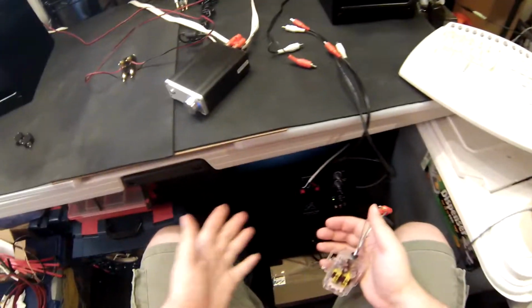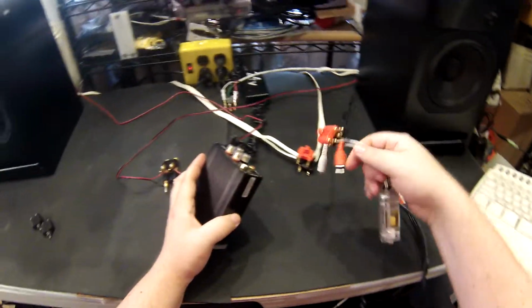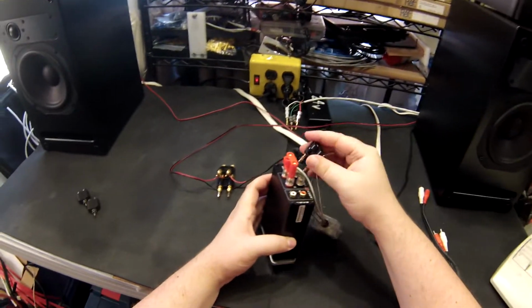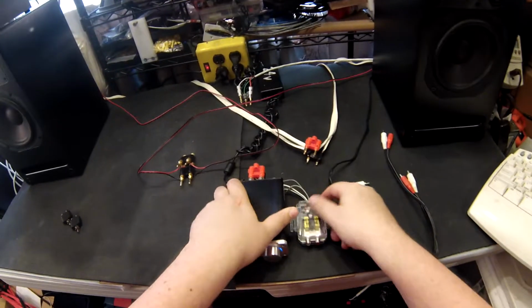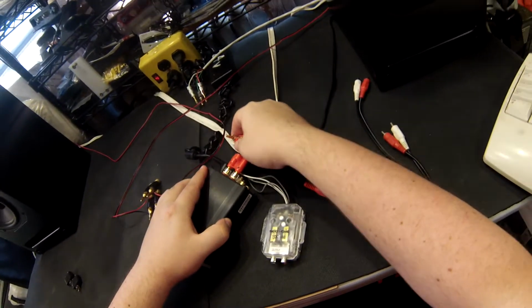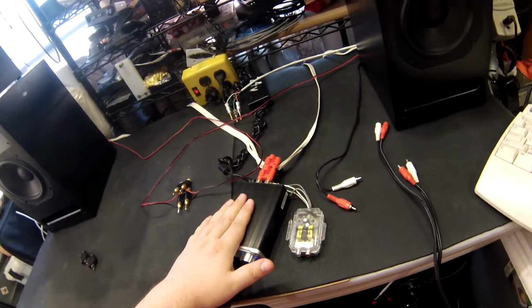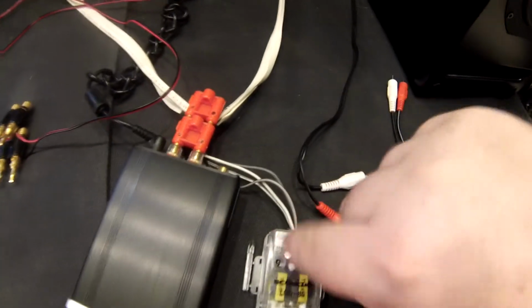So in this situation, the exact same thing is happening. We are going to intercept the amplifier. I'm doing it before. You could do it before or after. It doesn't make a difference. Plug our speakers back in to the back. So now this amplifier is powering the speakers, these big speakers, and the power is passing through this device. And there's gain adjustments. Just turn them all the way up. There's little gain knobs you adjust with a screwdriver. Turn them up, turn them up.